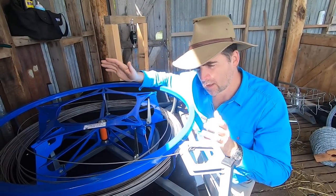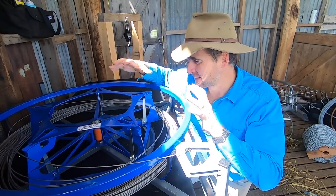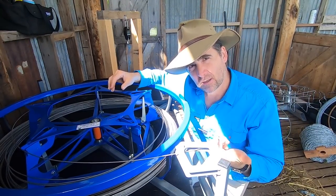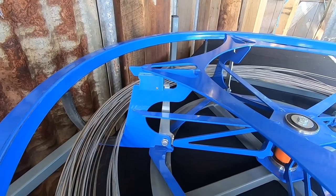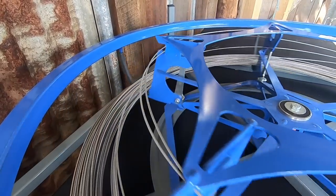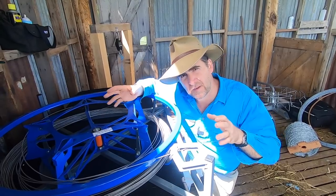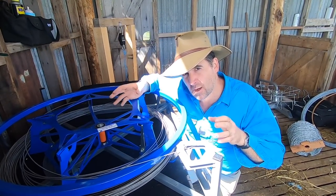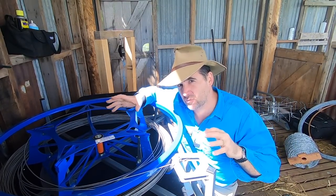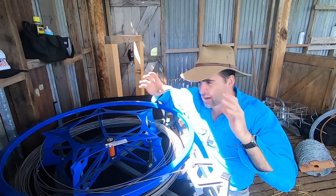Just like the other contractor spinner, pulling wire out of this is child's play and silky smooth. When you've been using cheap spinners most of your career and you step up to something like this, you see why contractors who are running wire out every day spend the extra money. With one finger I can pull the wire through the feed past the roller bearing — as soon as I start pulling, the angled internal arms feed the wire up to the brake, release it, and it feeds through silky smooth. As soon as you stop pulling, it falls out of the brake and won't move. The Fenceline Solutions and Walters Fencing spinners are both made for much higher speed and are really the business if you're a contractor — specialised spinners that make running plain wire out along fence lines super simple, super easy and super fast.